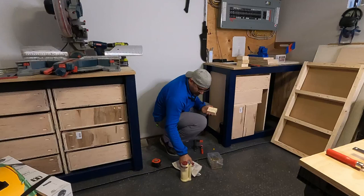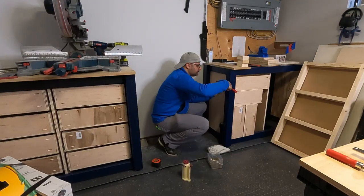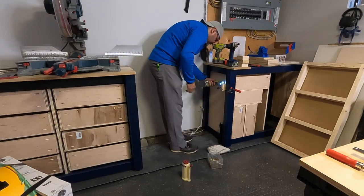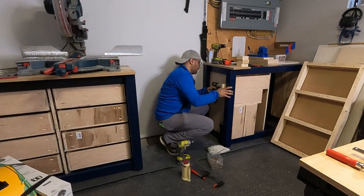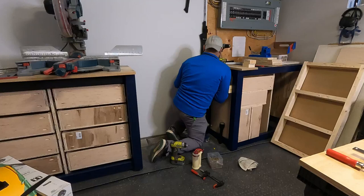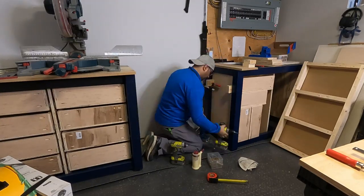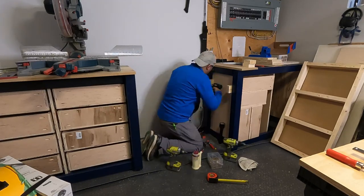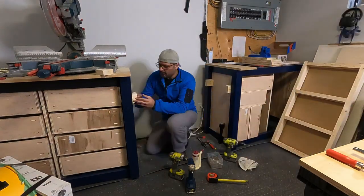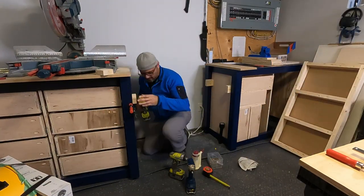This video is slightly out of order, but thanks to editing I can keep the flow going. After installing eight drawers I took a break to install the middle platform that the miter saw will rest on. Measuring the height of the table saw, the three-quarter-inch MDF top, and the three-inch frame, I calculated that the braces need to be seven and nine-sixteenths of an inch below the surface of the table. With that calculated, I glued and screwed the braces.